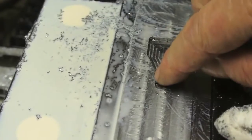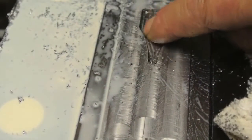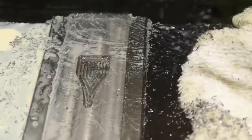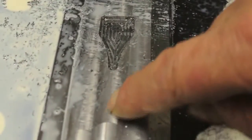Basically, you put the component into that depression there. I will be cutting a slot out of here to accommodate the depth of it. The flange will sit on this part here and across here — the rest of it will fall through basically. I think I'll do some hand milling to get the rest of it to fit, as it's more than it's worth to set up a program for it.